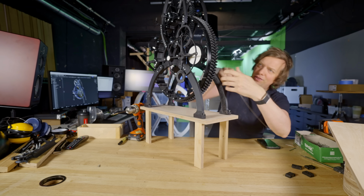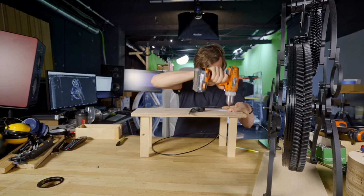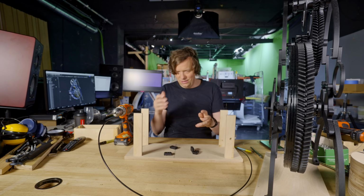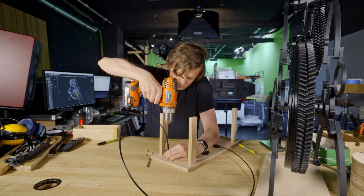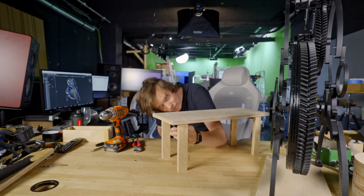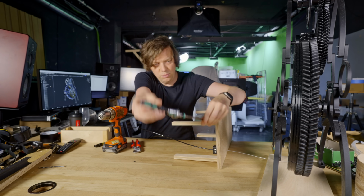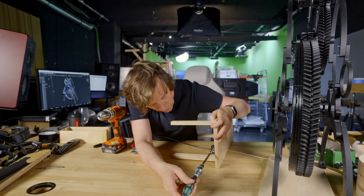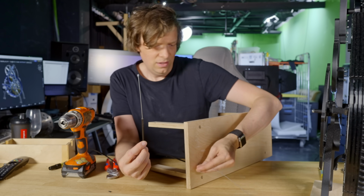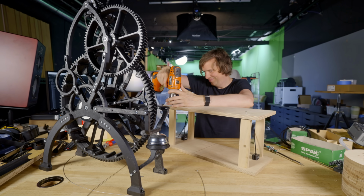So the Bowden cable runs on these tracks. So I need to drill 2 holes exactly below it. And then we can add these holders for the Bowden cable. Okay, so let's feed this small. See if I can hit this. I could. And then it's important I tighten it not too hard. I just wanted to hold the cable without making this movement any resistance. Perfect.